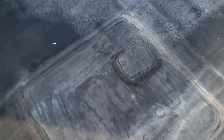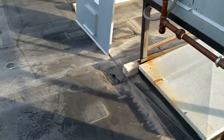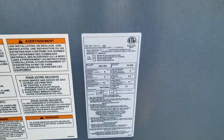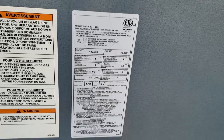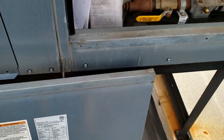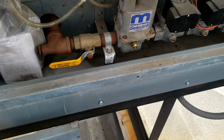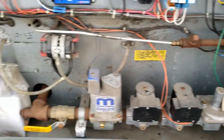Filling out to that size looks pretty decent — I want to be in the center of the burner but that's about where they want it. It could be a little smaller; what a flame that's slightly big can cause is a high temperature rise when you don't have a lot of call. That's also why you don't bring it on during mediocre outside temperatures. We've got the minimum position set. The high fire rate will be set based on discharge temperature rise — probably around 70 degrees rise; I'll have to check the paperwork.